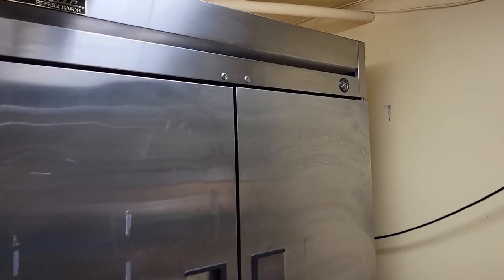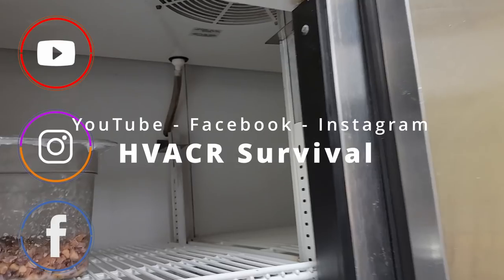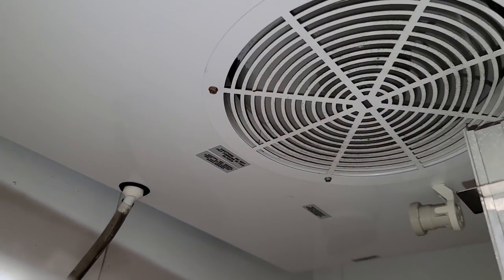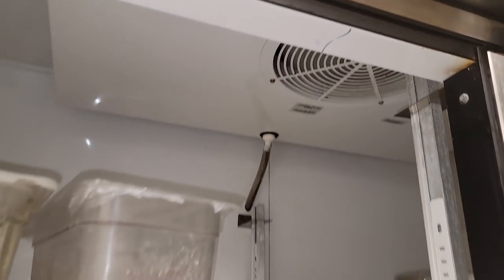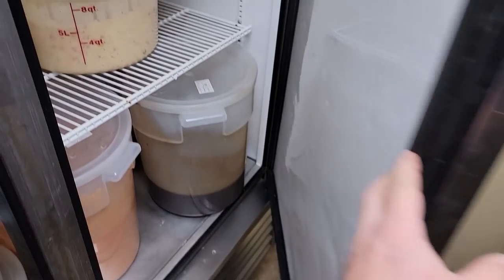The reason I'm here is because this cooler's running a little bit warm. I just had it open a minute ago but it's not doing real good on temperature. This is one I think we looked at the other day and kind of just set it a little bit lower. The coil looks clean - the vinegars and things like that, it wouldn't surprise me if they're causing leaks.